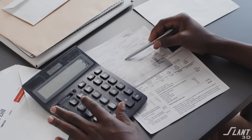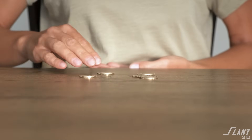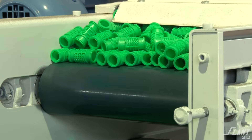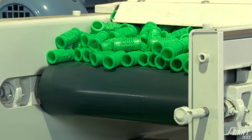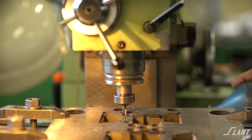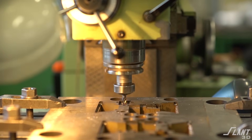You also have to realize there are downstream costs: assembly of those pieces, the error rate, and transportation — because in order to amortize the cost of the mold, you have to produce hundreds of thousands of them. You have that big upfront cost. Not to mention that once you commit to the mold, that design is literally set in stone. So producing with molding creates a lot of complexity if you're a company or startup wanting design flexibility or evolving quickly to meet customer needs.